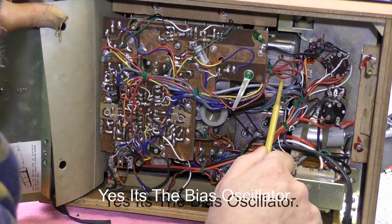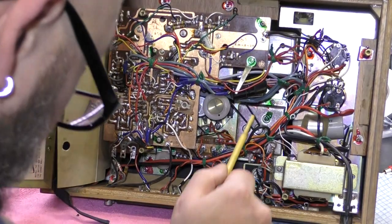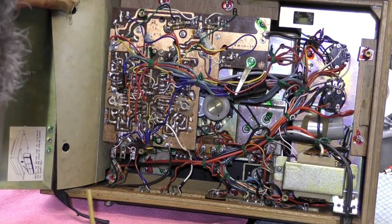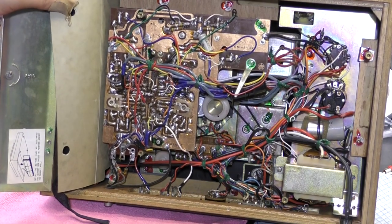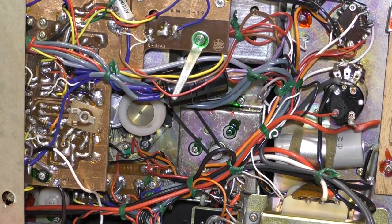I don't know what's in this metal box — there's a couple of presets, unless it's a preamp or something. The motor — no idea, could be centrifugal type rather than a DC one. Anyway, I'll bring it up slowly and just see what happens. Well, I've powered it up and no smoke so far, which is good news. Interesting about the motor — it reverses for rewind, so it's one of those sorts of mechanisms, and you can no doubt see the lump in the belt and hear it.